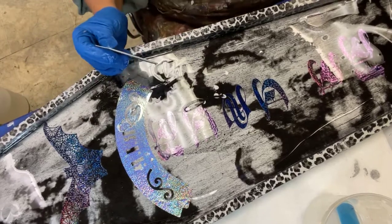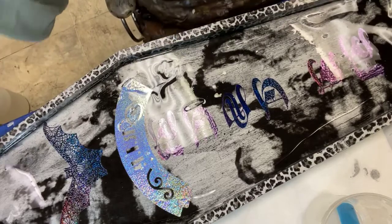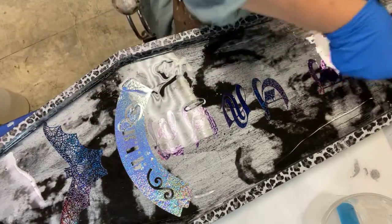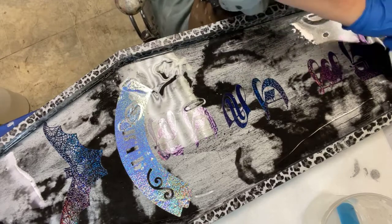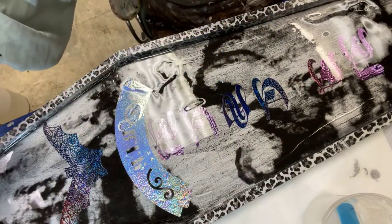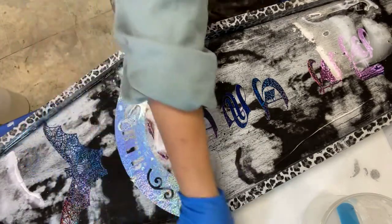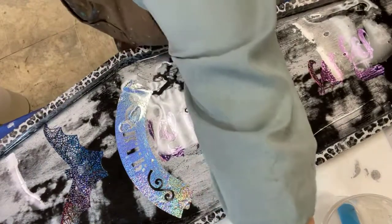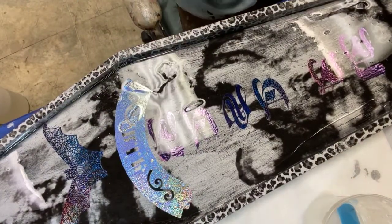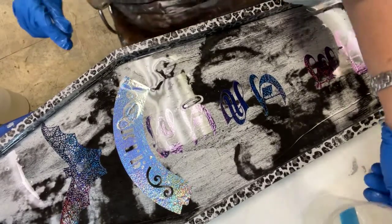And I think I'm seeing that I need my shims on this end because all my epoxy wants to go that way. You can always tell because it's not as thick up here as it is down here. So I just need to put a couple pieces. Actually, for this, I don't even need to do much more than put a popsicle stick or two under here because it's really not off by that much. There we go.